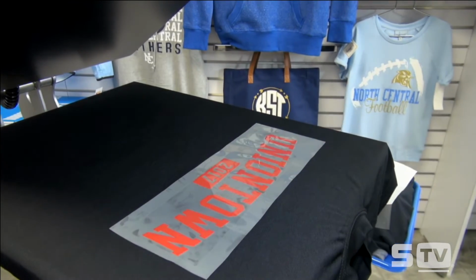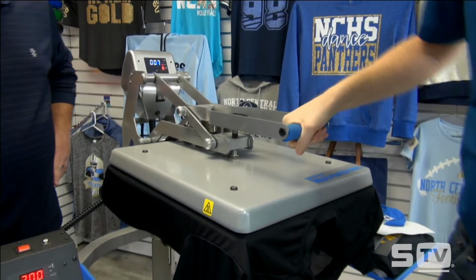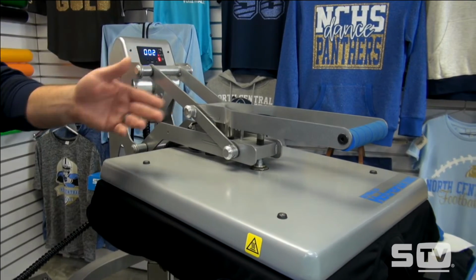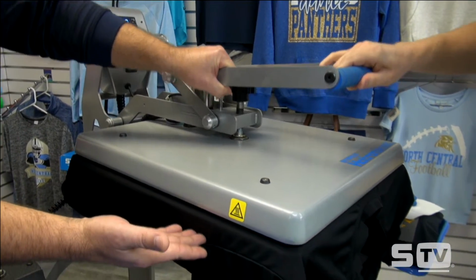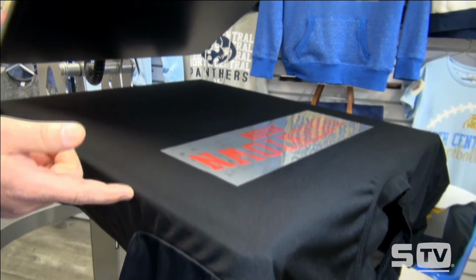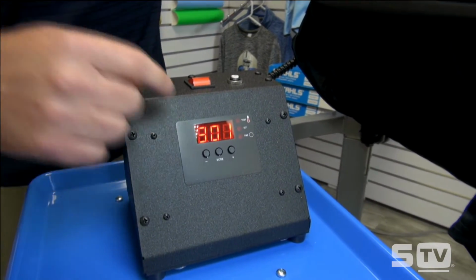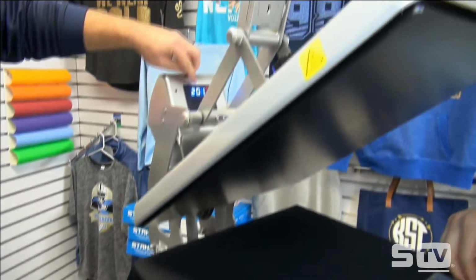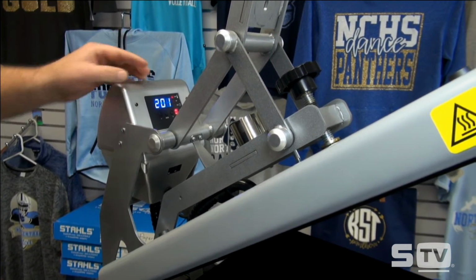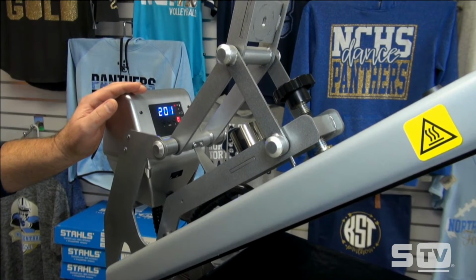So basically he aligns that down. He's going to go ahead and lock our standard press down, and we'll tell you what's going on, and you have to listen quick because it only takes 8 seconds. And we're on a medium pressure. Basically what we did is we heated the application from the bottom at 300 degrees Fahrenheit, and that's run through this controller independently, and then we also have a top temperature that we were able to decrease to 200 degrees. So instead of having the old 330 degrees on the top